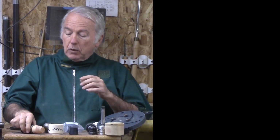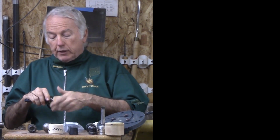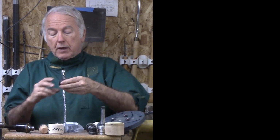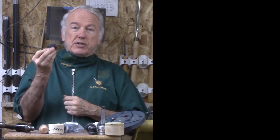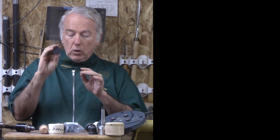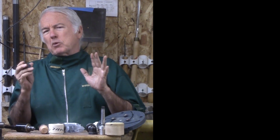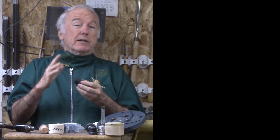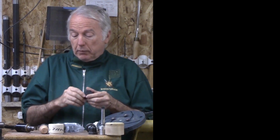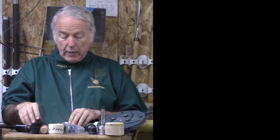Now, if you are wanting to pad the point beyond the penny, and you're willing to spend a little bit more money than the 1 cent here, buy some number 6 or number 7 rubber stoppers, solid, no hole. These are number 7. The last batch I had is number 6. I think I prefer number 6, but they both will work because, hey, I have turning tools. I can turn it thinner if I want to.